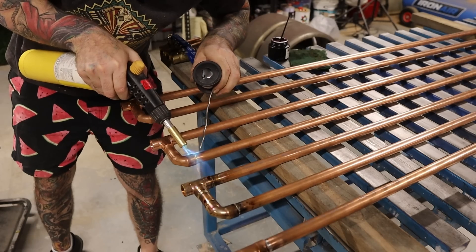It's got pressure in there now — I started out at 50 PSI and then dialed it up to 100 PSI. She's currently holding 100 PSI and I can't hear any leaks. All the ball valves are holding as well, so I'm pretty happy with that. I'll probably get some soapy water in a spray bottle and spray over all the joins just to make sure there are no bubbles from any air leaks. I think it's pretty good though — I can't hear anything. The next step will be to mount it up on the wall and then she's pretty much done and I can test it out.